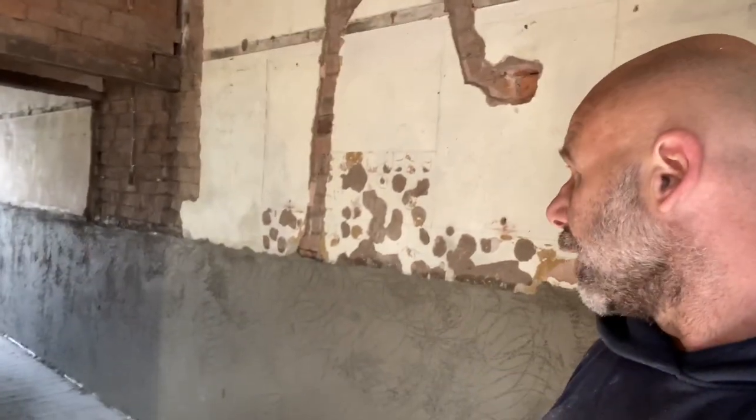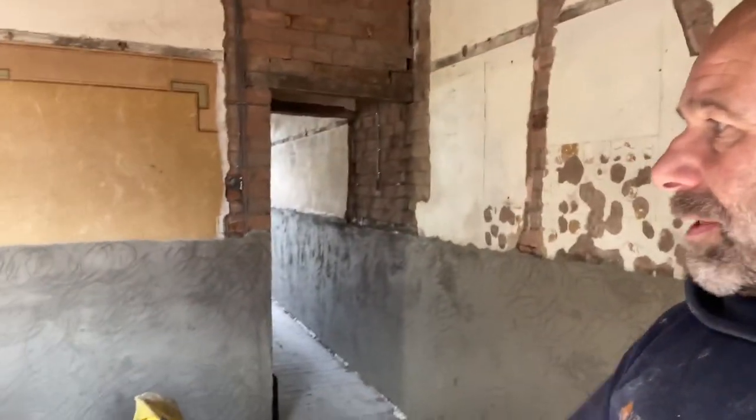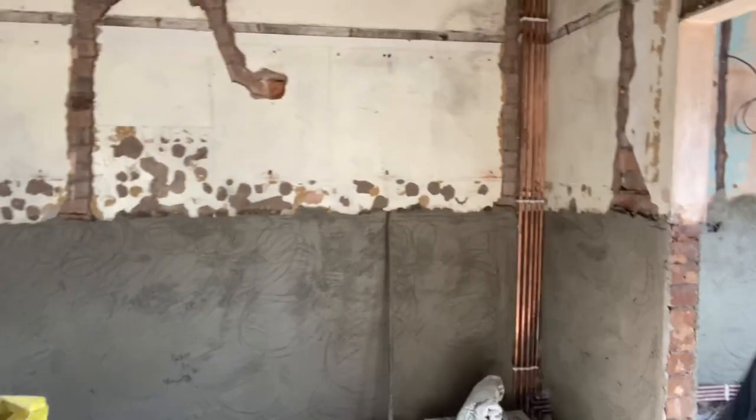They'd had a bridging issue with old plasters - there were salts on the wall at low levels, some old damp, and the damp course was bridged underneath. So basically they've hacked off a metre higher and we've come in and done our bit - it's actually 120cm, higher in places. So I've come in and just put salt neutralising plaster on. The old plasters had salts all over and were an issue around the bay, so we've sorted that out as well.